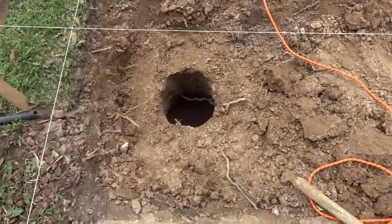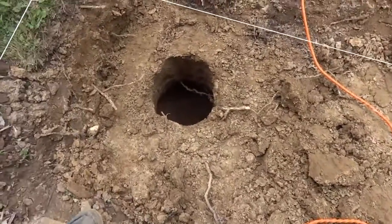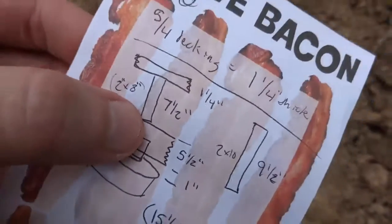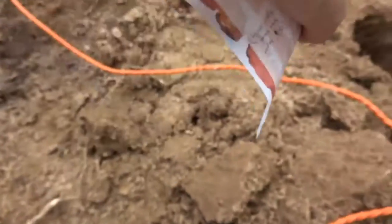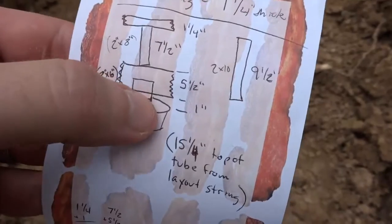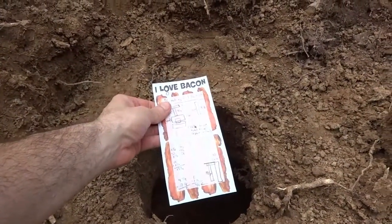I finally got all three holes dug out and cleared the huge dirt piles. I think I dug a little deep because that post back there is set to the right height, but that's okay I can fix that later. Looking at my drawing: the decking on top is an inch and a quarter thick, my two-by-eights for joists are seven and a half inches wide, the beam going across uses two two-by-sixes sandwiched together at five and a half inches thick, and the metal bracket raises it off the concrete one inch. Add those all together and I get fifteen and a quarter inches — so the top of the concrete tube needs to sit at fifteen and a quarter inches.